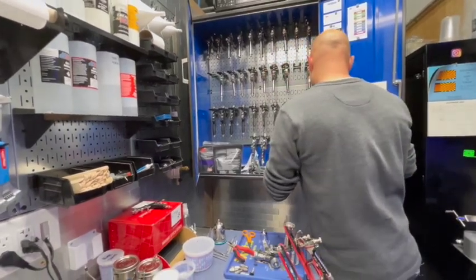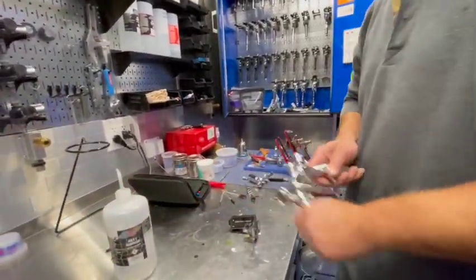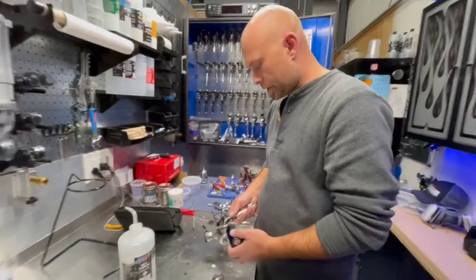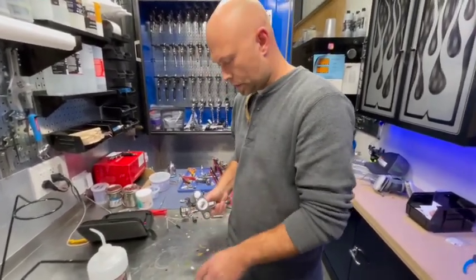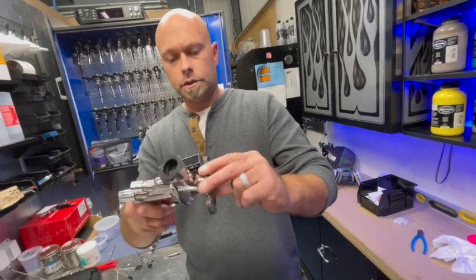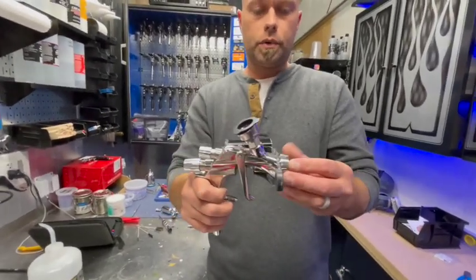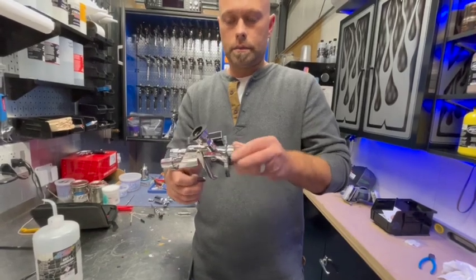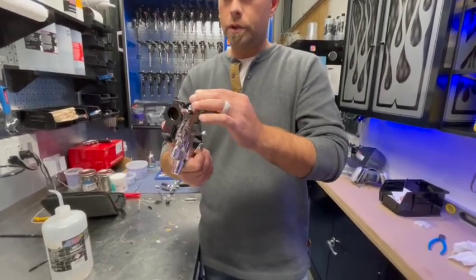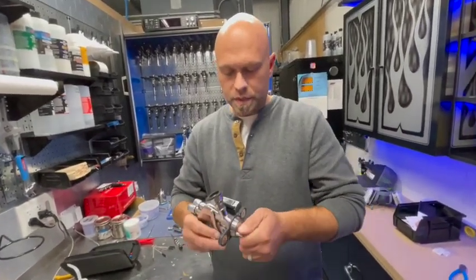There are probably many painters not familiar with this equipment. This Luma Air fits the Supernova. You take the air cap off, and this little plate goes right up to the packing nut. Then you put your air cap back on and snug it up. It's just a pressure fit — it doesn't affect the air cap in any way. It's designed so it doesn't impede any performance of the gun.